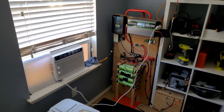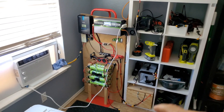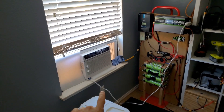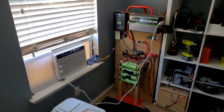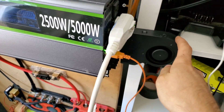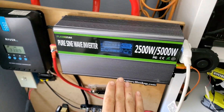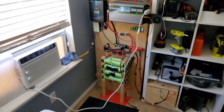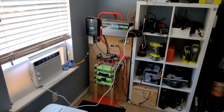This is kind of the base video - I just wanted to show you the system. I've had it together over a year, mainly using it to charge power tool batteries, RC car lipo batteries, and my electric lawnmower. I just threw the air conditioner on to see if we could run it - it pulls about 500 watts at full power and the inverter doesn't seem to mind. I actually glued a blower fan on the inverter so the internal fans don't have to kick on since they're extremely loud. We're gonna change that in the near future, and I'd also like to get a bigger charge controller, but so far it's been pretty reliable. Thanks for watching.